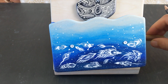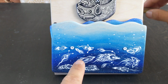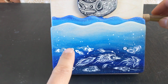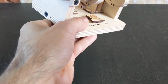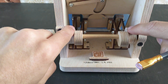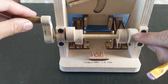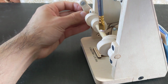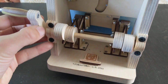And the way I'm getting this waving motion is that each one of these panels, this one and that one, is attached to 2 cam followers. And if you look at them from behind, each set, so this is the front wave, has cams that are slightly offset, or at a different angle in relationship to the axle. That way there is a sort of alternating motion.